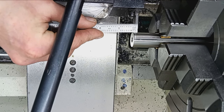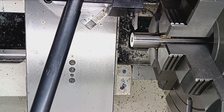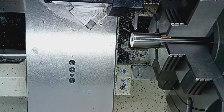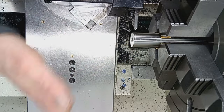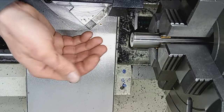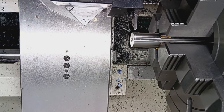Well, the whole thing is to start from a fresh section of barrel, so a quarter inch should be plenty. Like I said, I don't think I got footage of it, but there is a little schmutz right there at the beginning. So we're going to get rid of that portion and then face it flat. I'll check center again, make sure it didn't slip out one way or another, and then proceed to crown it. So no threads, 11 degree crown, target crown, simple stuff.